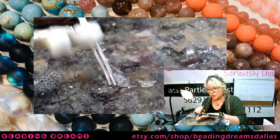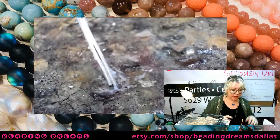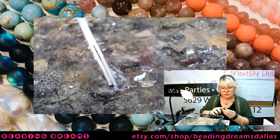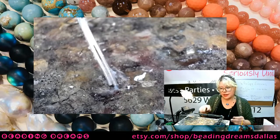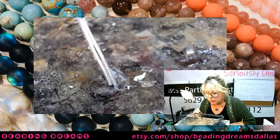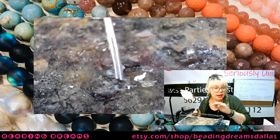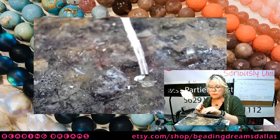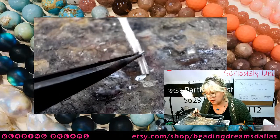Metal conducts heat. So when we heat any part of a piece of metal, we're essentially heating all of the metal, and the metal is trying to take all of the heat and conduct it throughout its area. So any part of our metal that we're not actively heating with our torch is essentially stealing heat from where we are heating and trying to redistribute it throughout the rest of the metal. So the problem here is that if we don't keep our entire piece of metal at or close to the temperature where solder can flow, it doesn't have to be at, but it has to be pretty close, the heat sink effect is going to counteract our heat to the point where our solder is not going to flow, and of course we do not want that.